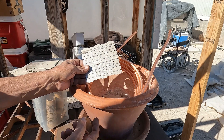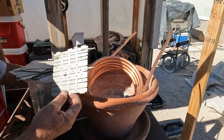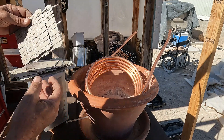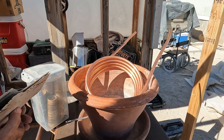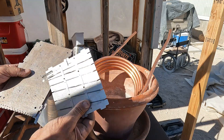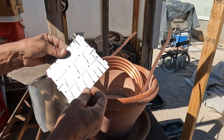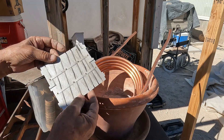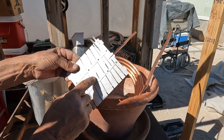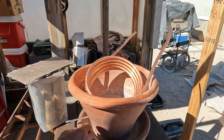Inside of here I have a toaster element — not this particular one. As you can see I've been collecting them for a while, but I'm not going to do much more of that. I think I have one about like this one with a heavier gauge, and it just happened to work out the ohms. I think I had a couple of that particular heavier gauge one, and it works out great with this 275-watt 24-volt solar panel.